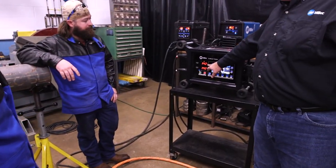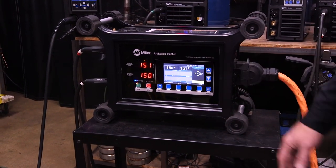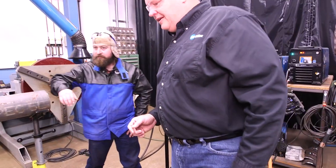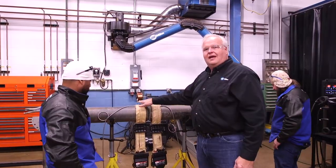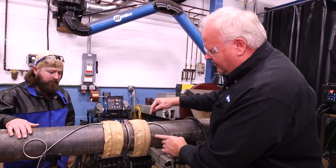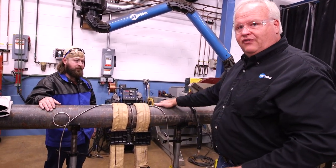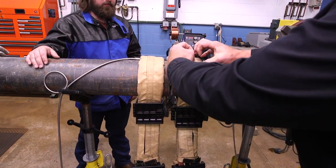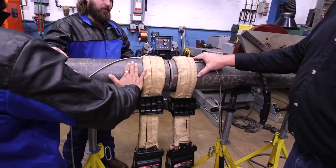We can see this was already heated up a good 70, 80 degrees in the couple of seconds we've been talking. So that took about 20 seconds for it to heat up 70 degrees. The cool thing about induction is that while this heating is going on, nothing here is hot to the touch. We're generating magnetic fields going around this cable — that's generating the electricity inside the part — and the parts are still perfectly room temperature. But you get closer to that coil and you can feel that heat starting to spread out and soak into the material.